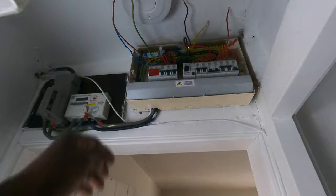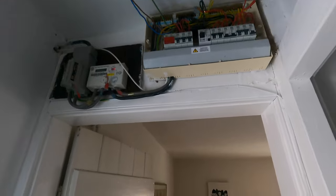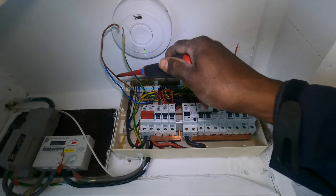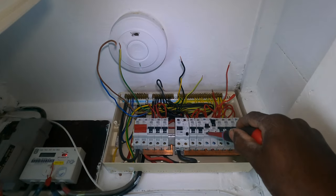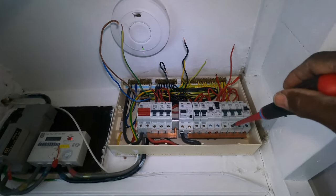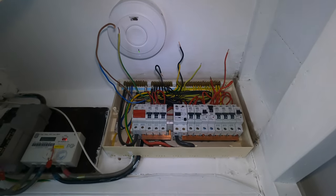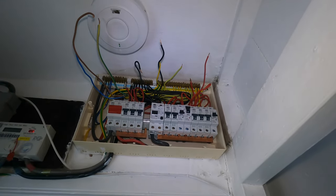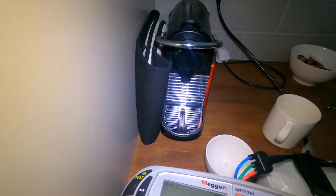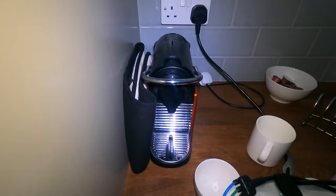See that detector? It's in the way when you try to use your screwdriver. That's the 16 amp I'm putting in for that radial, and these other radials I'm going to put one 16 amp there and one 16 amp here. So I've got that circuit connected. Now I'm going to go around and do my test. It was one of those jobs where I had to drop the whole thing out, put the MCBs in, then put it back and make sure they're all catching. I hate doing them, but it's done now. So I'm going to go around and test and see how it goes. That's 0.77 — that's the end of circuit reading, the loop impedance reading. That circuit's fine now — all working, one radial.